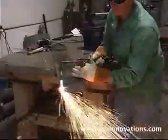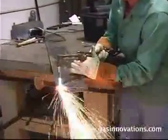On hand cutting, your cutting oxygen stream will only be two to three inches long. You will be able to start your cut on a square edge on cold plate in less than two seconds.